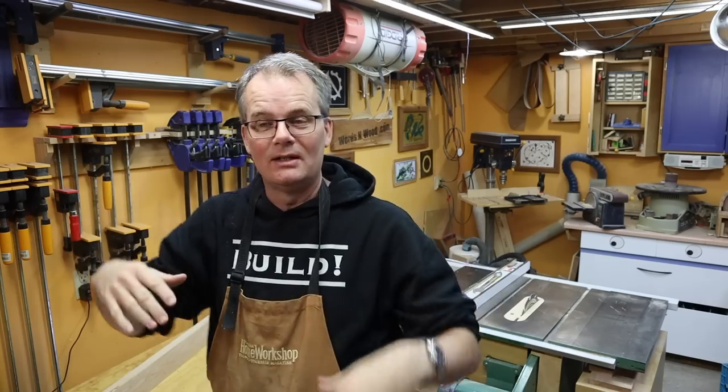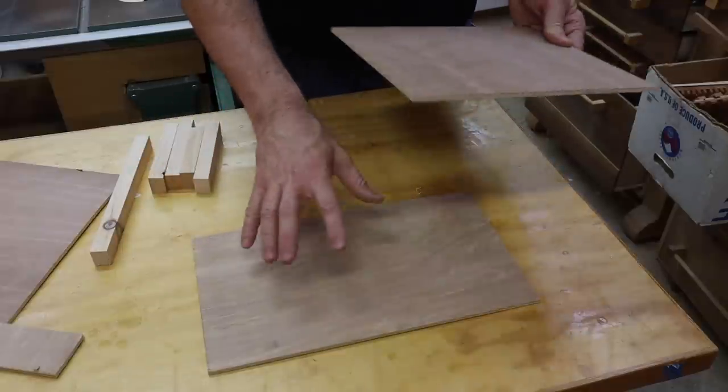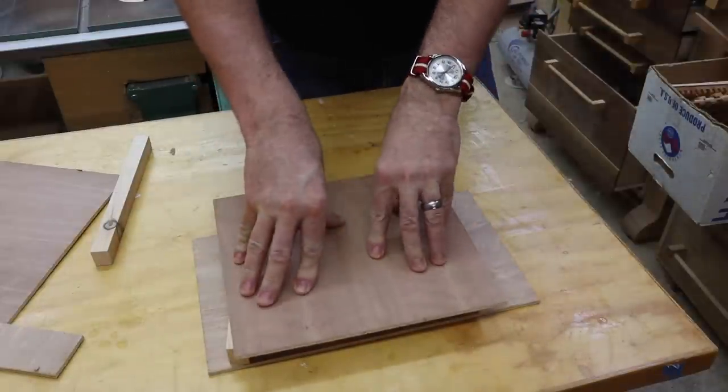It's several days later now and I have a plan. It took me a while to decide because in woodworking there's more than one way to do it. I figured the approach I'm going to take is to make a hollow core door — hollow core doors have thin skins with little bits in between, which is kind of like a torsion box. I thought about making this out of plywood or hardwood but it's a big door and I don't want it to move. A torsion box is when you have two sheets of thin plywood with a grid of lumber glued to both — the result is very light, very flat, and it's the flatness I want.